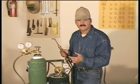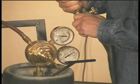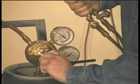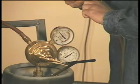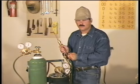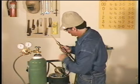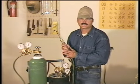For our demonstrations, we'll be using a number 1 tip with 5 pounds pressure. To adjust the regulators, you want the valve on the torch open. So open the acetylene valve on the torch and screw the adjuster in until you get 5 pounds. Then close the valve on the torch. And I'll do the same with the oxygen. I'll open the oxygen valve on the torch and screw the adjuster in to get 5 pounds here too. And don't forget to close these valves on the torch.